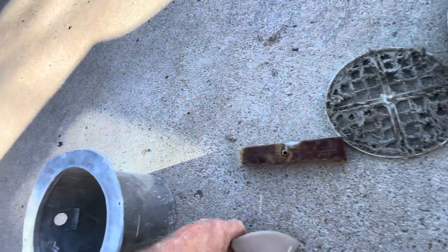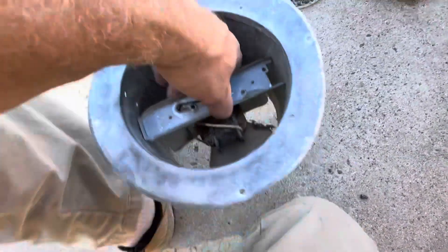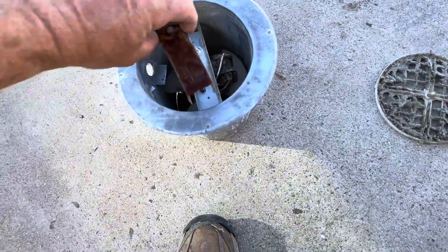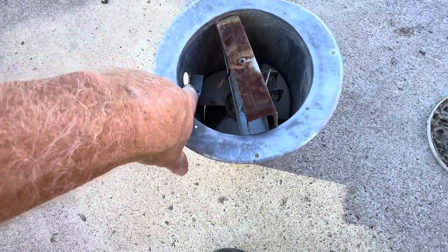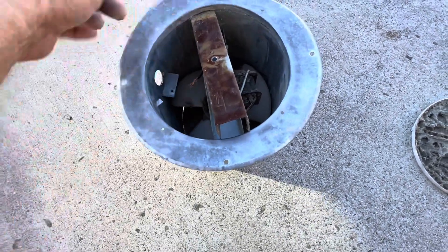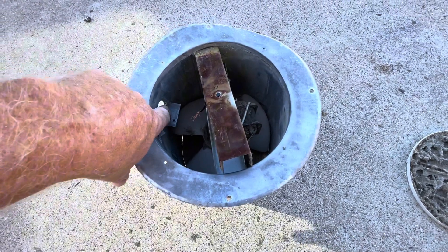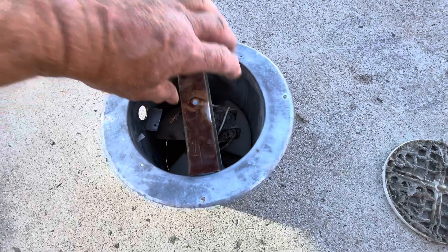It would actually be immersed from this, so it would sit in like this. This lid goes over this cover. Your wire comes in here. When they sent me the new fan, the fitting was facing inside here — pop it out, turn it around. It's supposed to be facing on the outside, and it says it right on the fitting. It's like a Romex connector. This is basically your junction box right here.